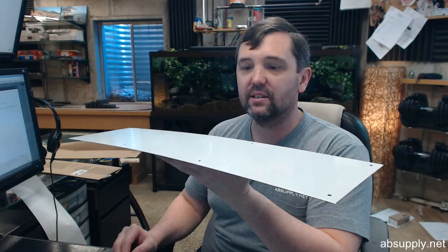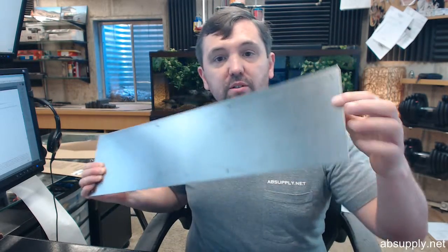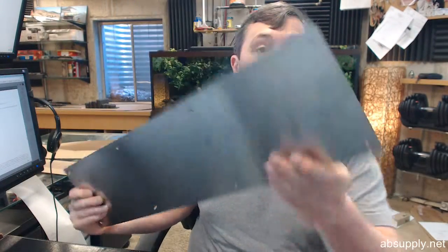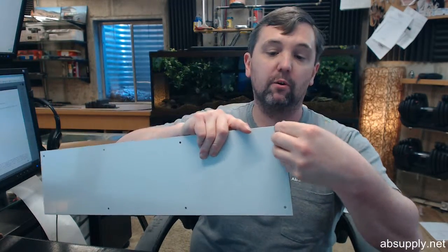The 198S is a very common type kick plate and is very simple, easy, and straightforward. It's an economy version of their 190S, available only in 32D finish, or 630 finish, which means that the base material is stainless steel and the finish is brushed satin. This is the back side — the front side has a peel-away protective film covering the stainless finish.